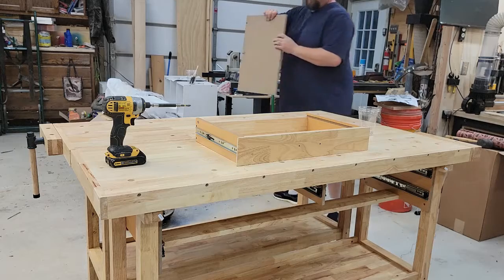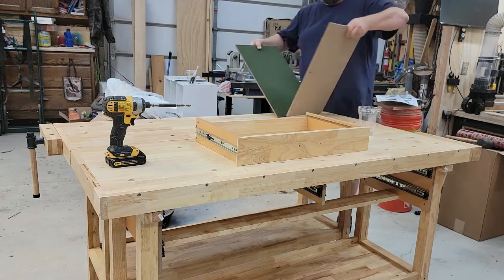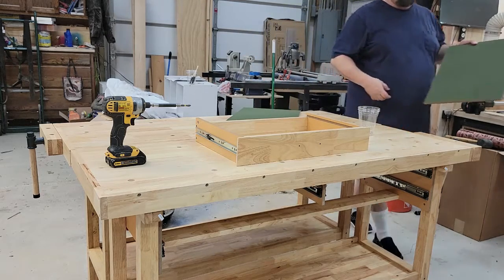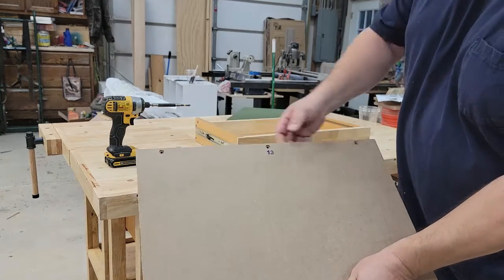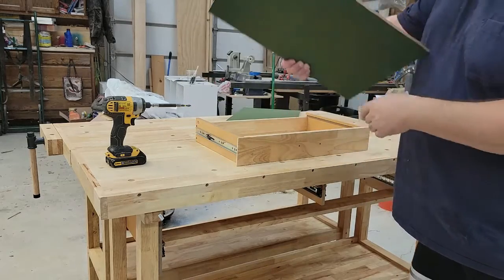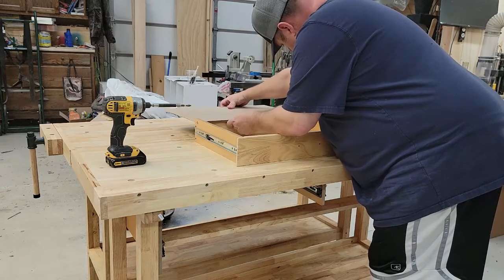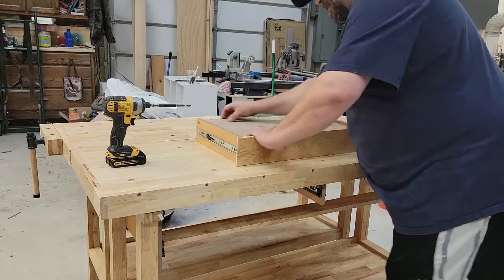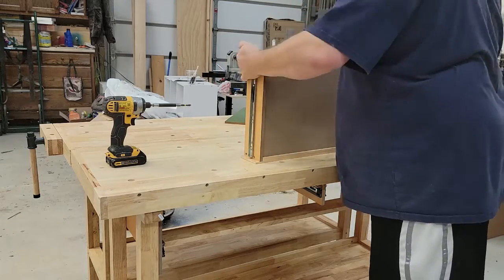Go ahead and take it off, and they have a velvet side that goes towards the inside of the drawer. Be sure to slide it in the correct orientation, and then using the pre-drilled screw holes, screw it down to the drawer back. After sliding it in, be sure that it's square before screwing it down. This way, your drawers will be square. It'll slide in a lot easier.